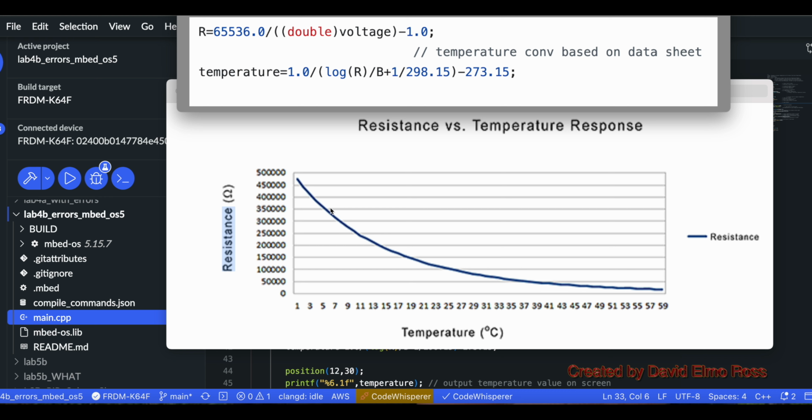And as we've seen before, this is a negative temperature coefficient thermistor, because as the temperature increases, the resistance here is going to drop. Now when it hits a magic number of 25 here, if we look up here, that's 100,000 ohms or 100K. And so that's sort of like a voltage divider, but this is the pattern that you're going to get, and this is how you read off temperatures here based on this formula. Now this formula is going to be based on having an unsigned short, and that's why you have to have it set up this way.